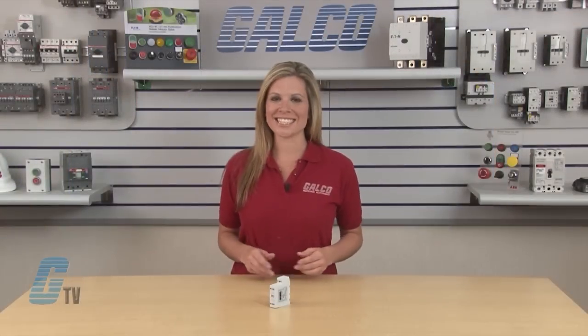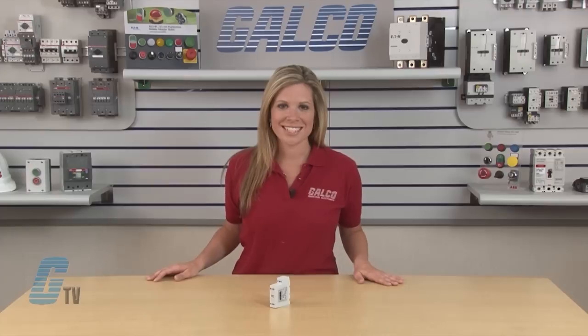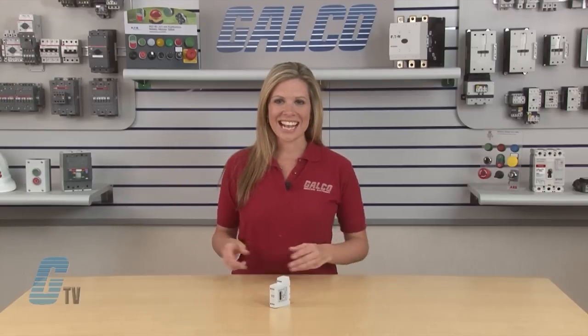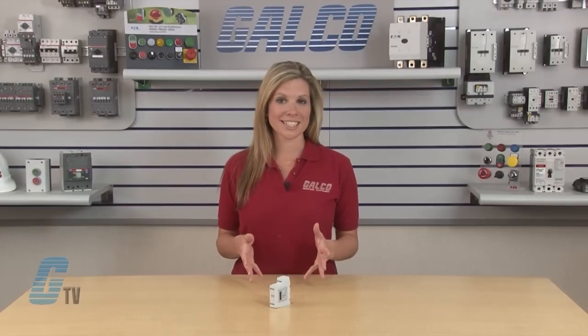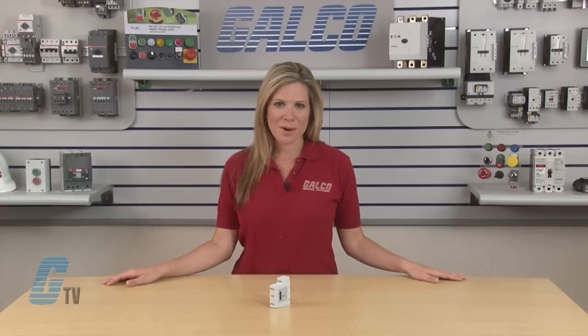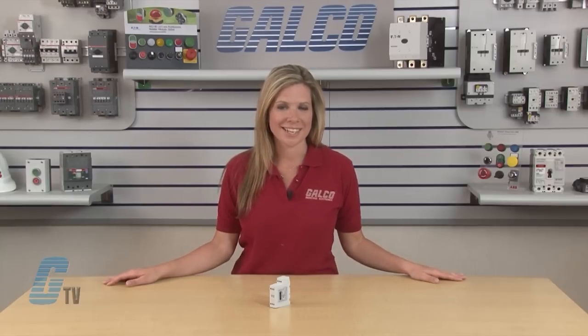Model STC DRS-232 has a max peak signal voltage of 15 with a nominal breakdown voltage of 22. The STC DRS-036 has a nominal breakdown voltage of 36 and a peak signal of 15. The STC DRS-060 can reach up to a peak signal voltage of 52 with a nominal breakdown voltage of 60.